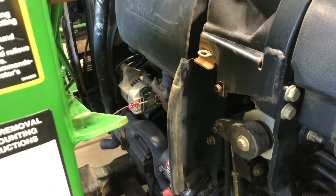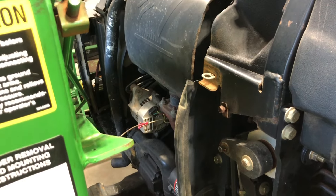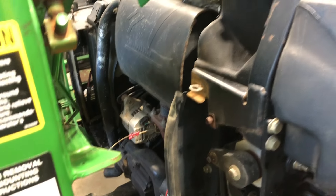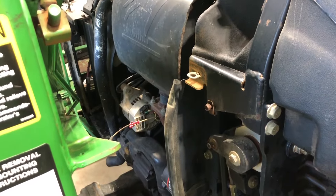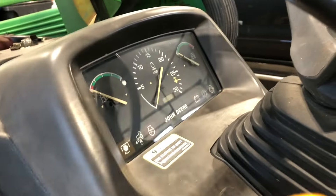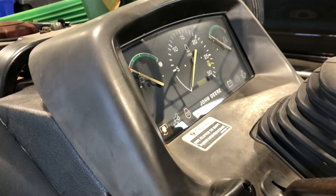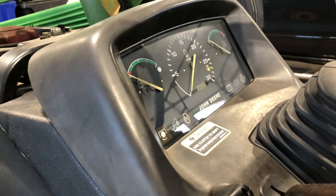The easy fix is to first check the sensor. The shop manual says normal range for the temperature sensor is zero to 700 ohms. If you run the machine for ten minutes and you're reading three to four hundred ohms on your ohm meter, the machine and sensor are fine — it's the gauge that's wrong. If the engine is fully warmed up, you're getting three to four hundred ohms, but when you plug in the wiring the gauge pegs way past the hot mark, the windings have shorted out and it takes far less voltage to peg that needle.